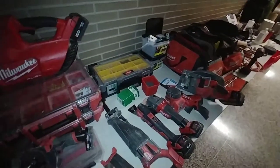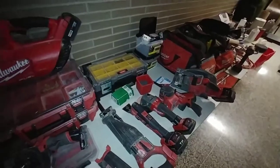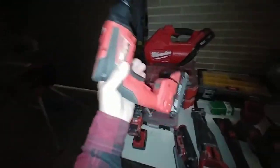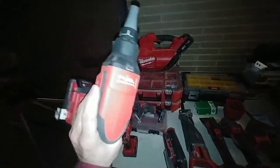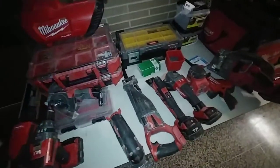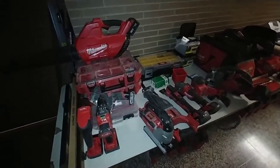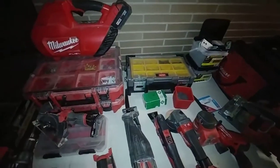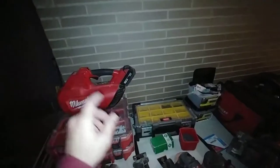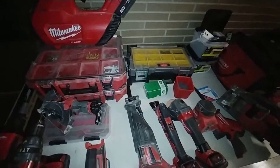I only use Phillips fasteners for drywall screws, for real drywall, and I own a drywall screw gun, which runs them in way more quickly and is well worth the investment. Especially for anybody like me that does carpentry and special effects work, it is awesome for using with the Luan, because you use it just like you use drywall. It's just massively time consuming to run little screws in with a conventional screwdriver gun. With a framing screwdriving gun, like an impact gun, it's just a nightmare.